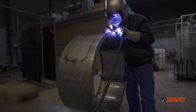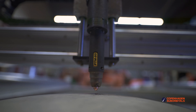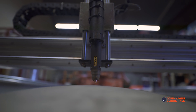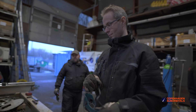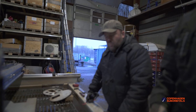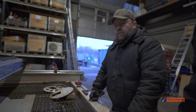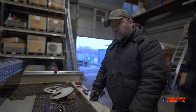One of the things we haven't tried doing in-house for the propellant tanks yet is cutting holes for the piping in their bulkheads on a plasma cutter. So after last week's successful sloping surface cutting test, we were eager to give it a try. We're going to try and cut a 40 millimeter hole, but there's some concern that the air pressure on the inside is actually going to make the end cap lift off from the bottom of the tray.